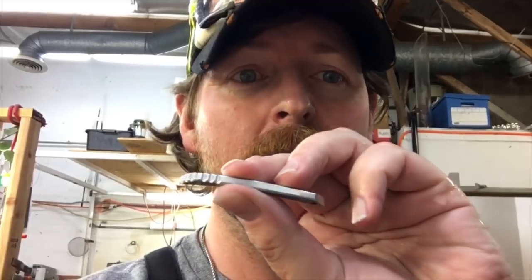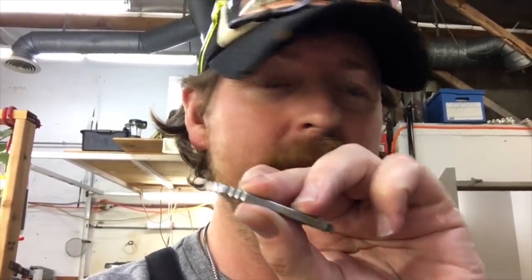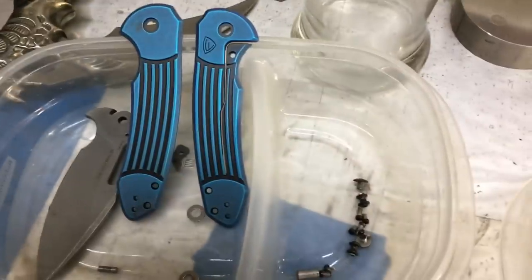The key is to do the things you don't like doing first — I hate polishing, but you do it right up front and it keeps the workflow fresh. Every once in a while you do something to screw yourself: I did all this polish, put it in multi-etch, forgot it's been hot and that's brand new multi-etch, and I etched it too far. Now I have to go back and re-polish, because multi-etch etches the titanium and opens it up to accept the electrically formed oxide layer — but if you leave it in too long, it goes cloudy and you lose your polish. I left it in about 10 minutes too long.